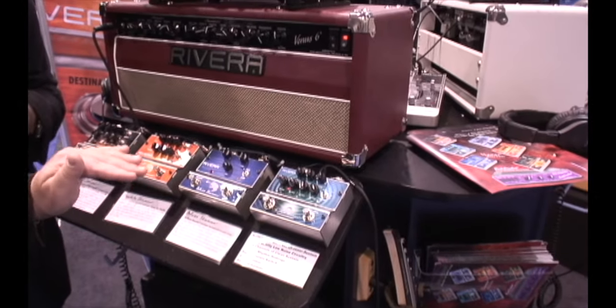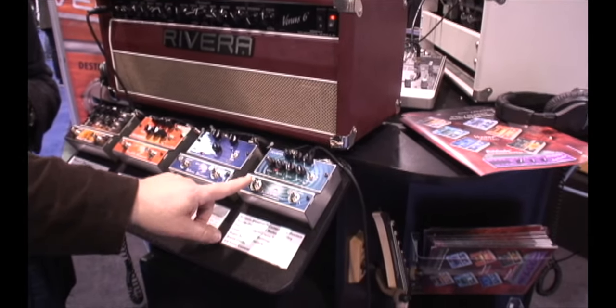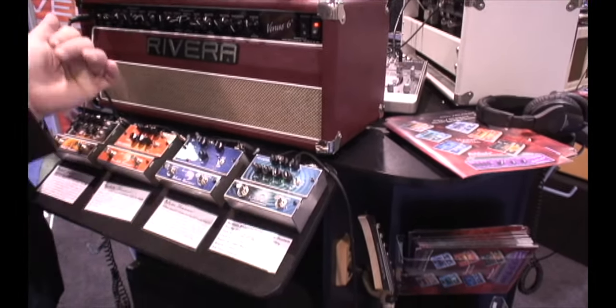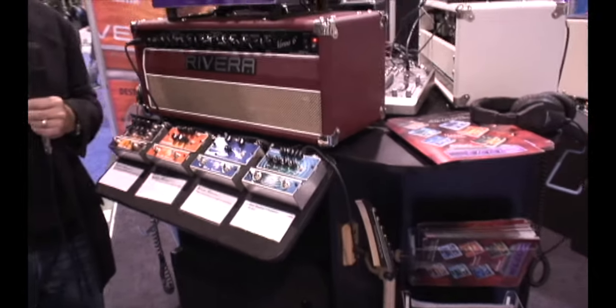What we did was took a rack-mount compressor from a clean sheet of paper — very sophisticated, low-noise circuitry — and stuck it in a box. What we've got is two different envelope trackings, which are very accurate. You can have a rhythm and a lead, two rhythms, or two leads. On this channel we have a super sustain switch, which allows you to get infinity's clean sustain. It has a blend control so you can adjust just the right amount of compression. There's also a tone control — for instance, if you're using a single-coil Strat and you've got a little too much click from the middle position on the pickups, you can attenuate the highs a little bit and bring in the level just right. It's quite a compressor, and it's probably the finest on the market. Most pedal compressors are variations of the MXR Dynacomp — they kind of copied the circuit and modified it a little bit. We started with a clean sheet of paper as if we were building a compressor for a studio, and that's what's in this.